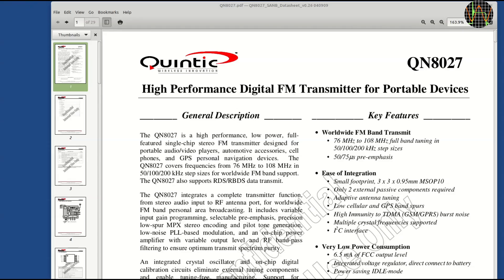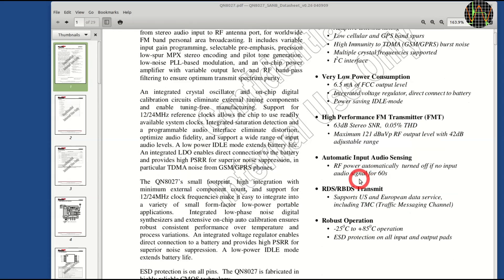The QN8027 could do a lot more than what the transmitter's user interface offers, which is a bit of a shame — but I am looking at it as a test tool and not for something to send MP3s to a car radio. For a start, it also supports 50kHz step size, which might be important to test receivers meant to operate in certain countries. The chip supports a choice of two audio pre-emphasis time constants, but we don't know which one has been selected by the programmers. Radio data system (RDS) as well as the RBDS variant is supported, but sadly there is no way of entering data like station IDs. A control interface via the USB-C port would be handy but it is not implemented — on my computer the USB port is just taking power and not recognized as anything like a serial port.